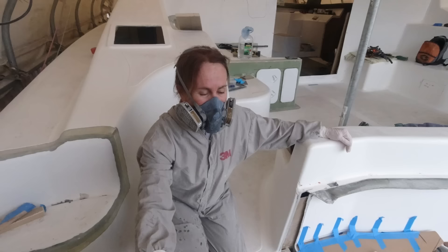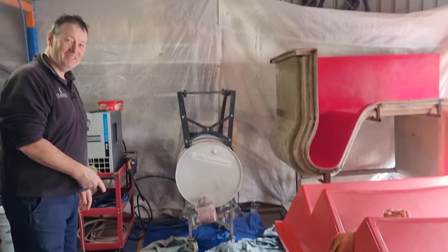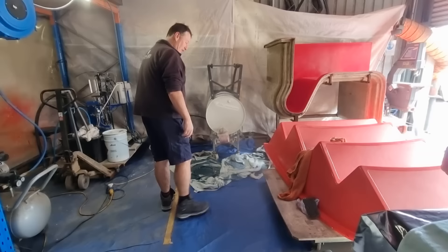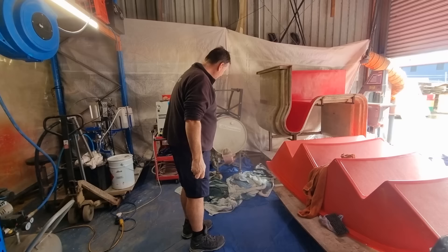It took me 100 goes to do that right. Now I've got this one right, I've got to replicate it — so it's been two weeks of hard work getting this together including all the fabrication of the foam. Lesson learned: never ever leave a drum of resin filling from a 44-gallon drum for more than about 10 seconds. Zoom in on that — lucky we had some spare bath towels because I reckon there's probably five liters of resin wasted. I heard this clang clang clang, came over and it's just spilling everywhere. Tarp your jobs guys — put tarps down everywhere because if you don't, you're going to wear it.